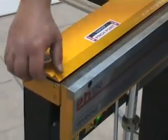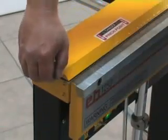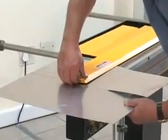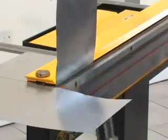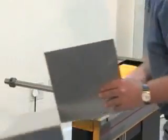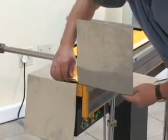An important feature of the Electrabrake is its open-ended design. This allows for many operations which are just not possible on conventional folding machines, such as this partial length bend. Notice how the lack of any structural connection between the clamp bar and the bed of the machine allows the sheet metal workpiece to project past the end of the Electrabrake.